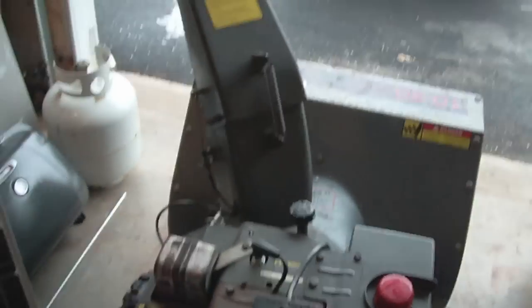Everything's back together, so just an overview. You only want to take out the screws on this plastic cover — one on that side, two on the other side. There's a bolt on this side and a bolt on that side. Those come out, the snowblower opens up like a clamshell, and then you replace both the belts. If you have it open, why not? I replaced them both with an A37 belt and an A38 belt — one is just a little bit larger than the other. I took it out for a little test and everything's in good shape. We're all set for another snowstorm, which I hope we don't get. Thanks for watching.